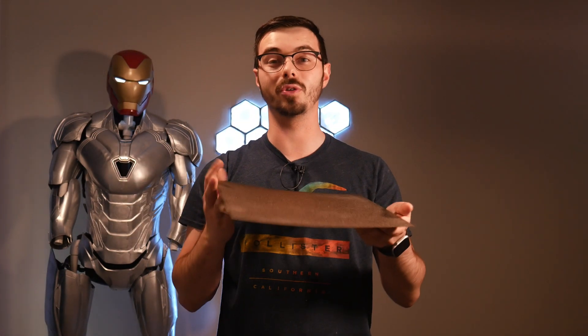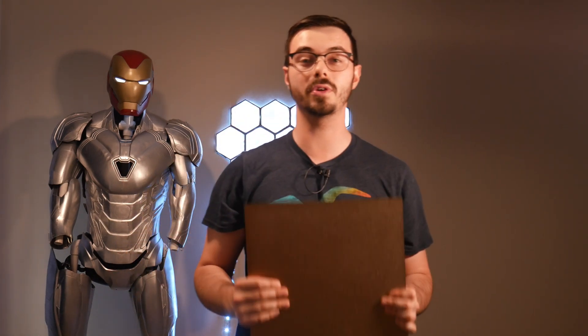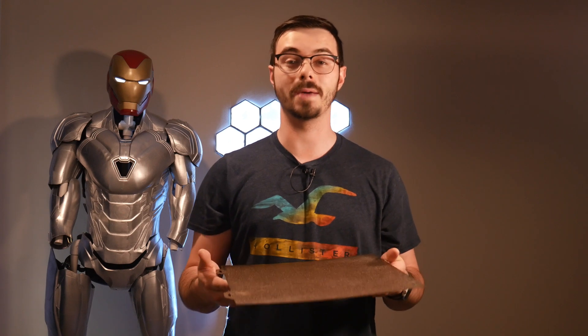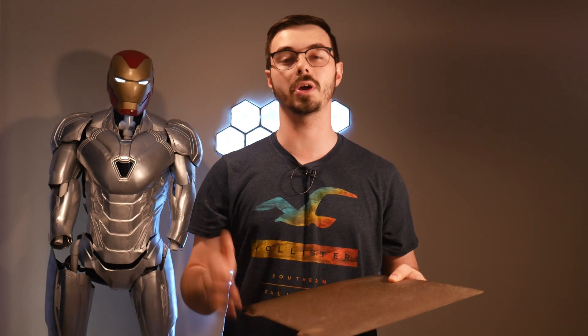They also have other types of flexible magnetic beds with different textures depending on what you're printing with — PETG, PLA, ABS — some will give you better results. I personally like the regular WHAM BAM flex bed. It gives me really clean prints on the bottom, and my surfaces are much better leveled because I'm not chiseling away and making the bed unleveled. It only takes one flex to pop my prints off, making the whole process a lot quicker. If it's a bit out of your budget, there's a link in the description with promotions sometimes available.